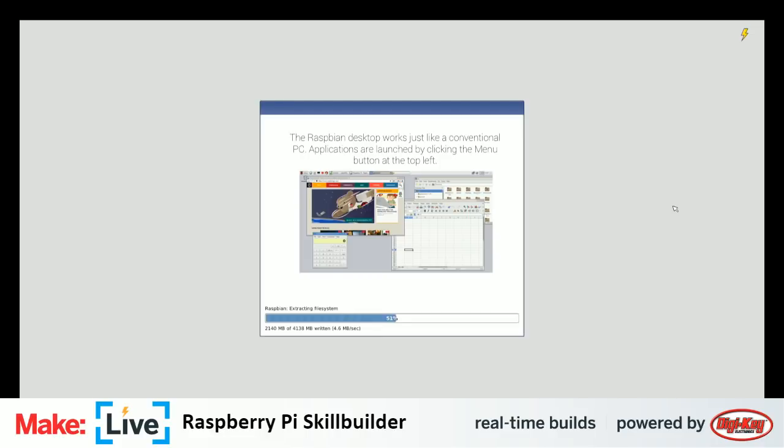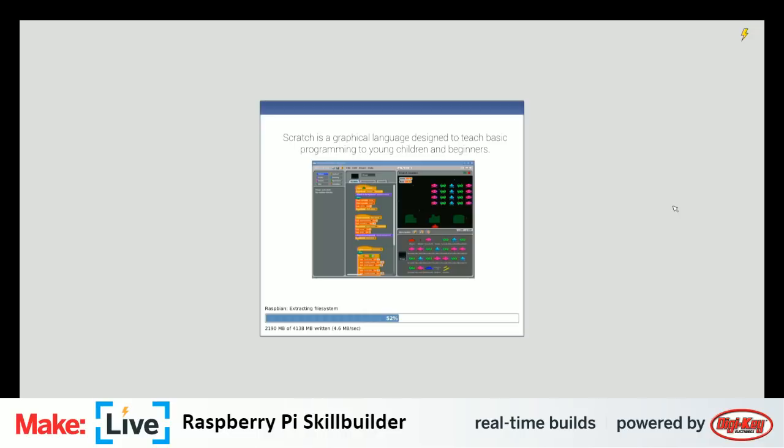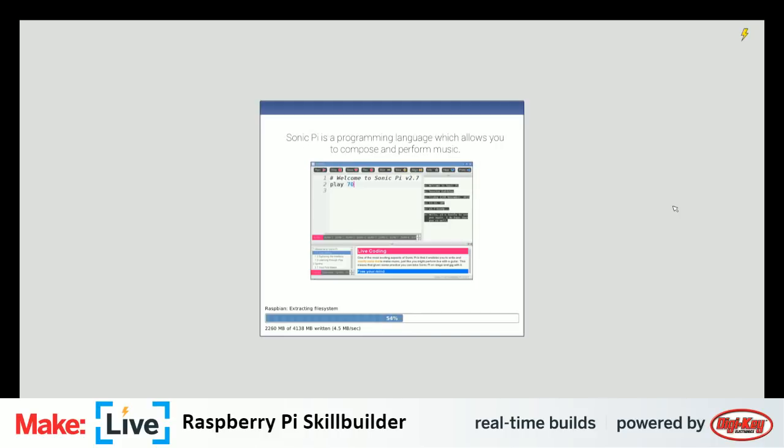Interesting to know, because I feel like I've seen that on just about every Raspberry Pi I've ever used. I know that there's different voltage requirements among the different versions, right? Yeah. Well, yes, but they're all USB. I mean, who knows with the various USB power supplies if they're actually delivering 5 volts, but that's what the spec should be. Right. Because that's just USB. It might be the cable, maybe? The cable is a micro USB, not rated for real power, but rated for that down-throttled. It is. This is also a pretty long cable, so I wonder if that is the cause. Yeah, we are running it around the ground a bit.